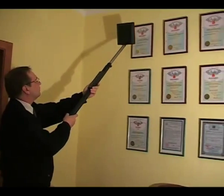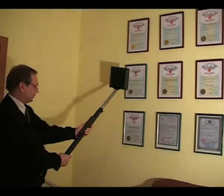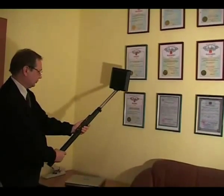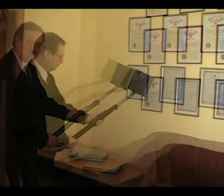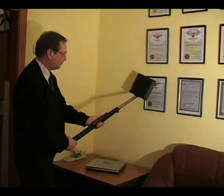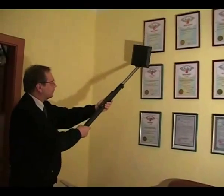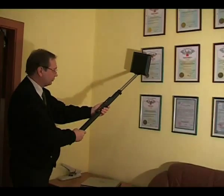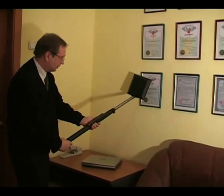Non-linear elements such as metal oxide contacts create a reflected signal with maximums in the third harmonic. The ACU-LUX allows detecting of any electronic device with semiconductor elements. Such devices may be concealed inside bricks, in concrete walls, in furniture or in safe boxes, as well as on the body, in clothes, shoes or private belongings.